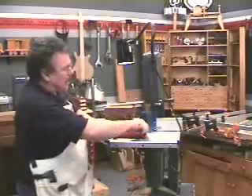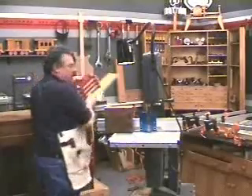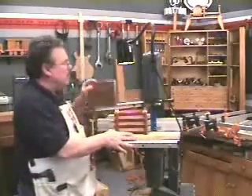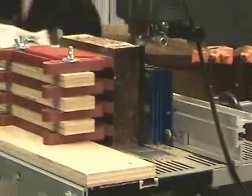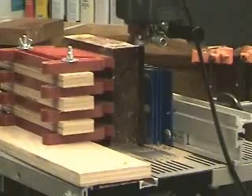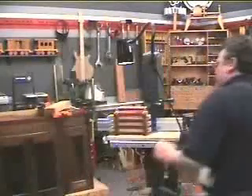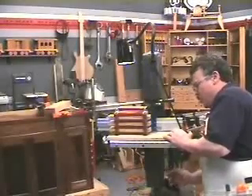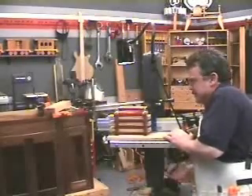On this, I probably will want to put pressure all along the back stuff, and for that I've developed this jig right here. As you can see, I've taken four feather boards, stacked them up, mounted them on a board so that I can mount this board right here on the bandsaw table, put on one clamp in back here, press it in against the wood, and another clamp on the front. I'm positioning these feather boards so they press the wood against the backstop just before it gets to the saw blade.